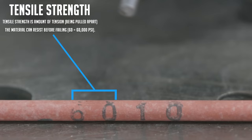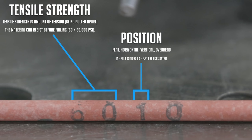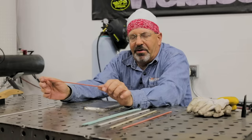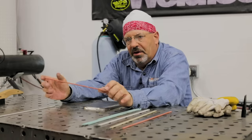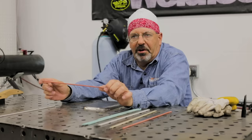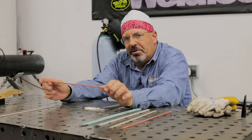The third digit, being a one, indicates position — and here's where it gets a little weird. One is for all positions; two is for flat and horizontal. So with a one, we're saying it's all positions — we can weld flat, vertical, horizontal, and overhead. But it doesn't tell you whether it can run vertical up, vertical down, or both.